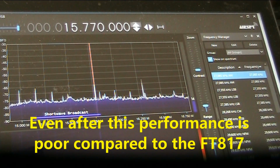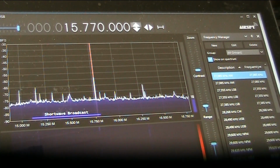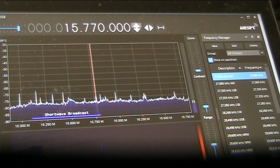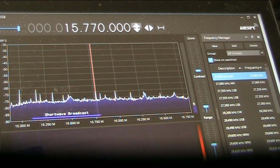As it stands, this very crude setup is not a great HF receiver, but there's a lot of things that can be done to improve it, like improving the coupling would be a start, maybe some RF selectivity, possibly some amplification, RF gain control, all these sorts of things. You could build a little preselector and probably be hearing HF.